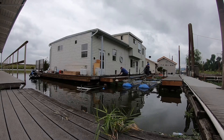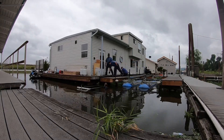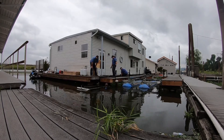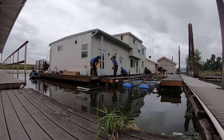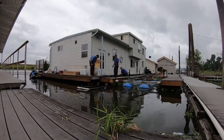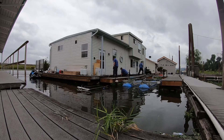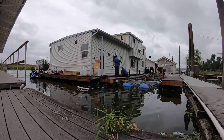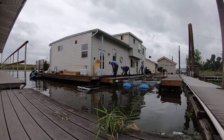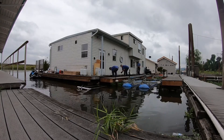So we had to drill holes in the PVC frame to get it to sink. Here we have the diver that we contracted to place this pond loop underneath the dock. We secured this to the dock with stainless steel aircraft cable — six connection points on this frame — brought up to the bottom side of the dock and anchored with eyelets, so it's very secure.